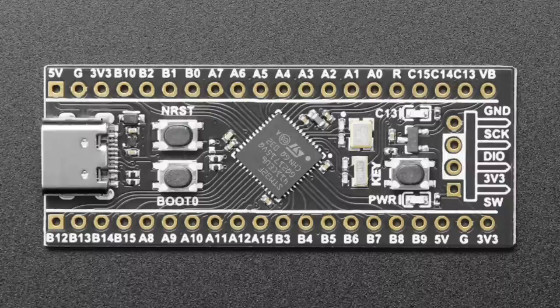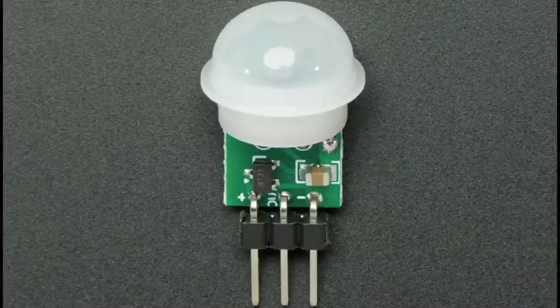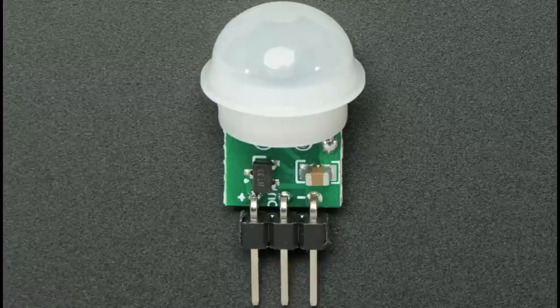It's minimal but has a lot of GPIO and is a nice powerful chip. If you want to get going with STM32 — especially in CircuitPython or MicroPython where you really want a Cortex-M4 and a good amount of memory — this board will give you lots of GPIO, USB-C power, and you can get going quickly. We don't make this; it's by Weact. Search online for "Black Pill STM32F411" and you'll find lots of tutorials and projects.